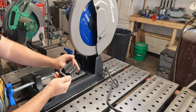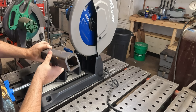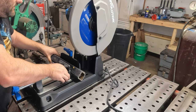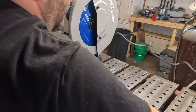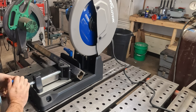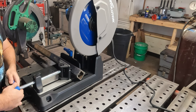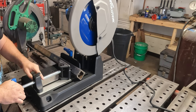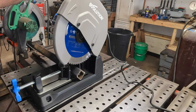This here is for cutting square tubing — I think it just slides over top and kind of floats. I have some two-inch by two-inch quarter-inch thick wall tubing and we are just going to cut a chunk off. I'm going to time it and see how long this takes to cut through versus my Hitachi. One thing I noticed right off the bat — the ability to clamp this thing down — I mean I can get a ton of pressure with two fingers. This lead screw is much much better than the normal threaded rod on my Hitachi abrasive saw.